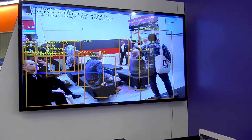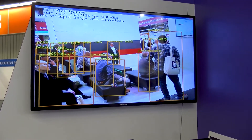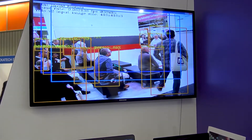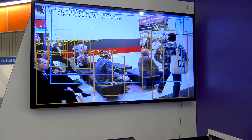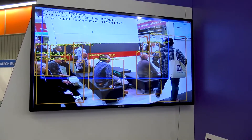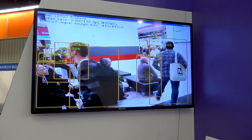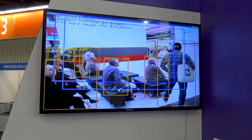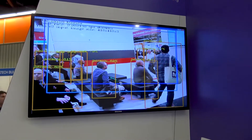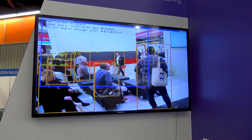So it's less than real-time for this application, but we can see the results here for the YOLO V2 CNN graph. We're running at approximately one frame per second, and the FPGA is running at 30 MHz. It's doing detection from a live camera that we have here at the Embedded World exhibition, and you can see it is showing the detection of furniture, people, objects, based on the camera input that we have over to the right.